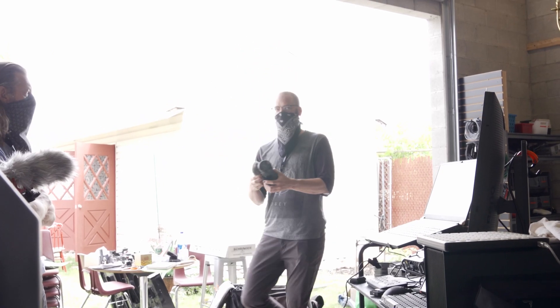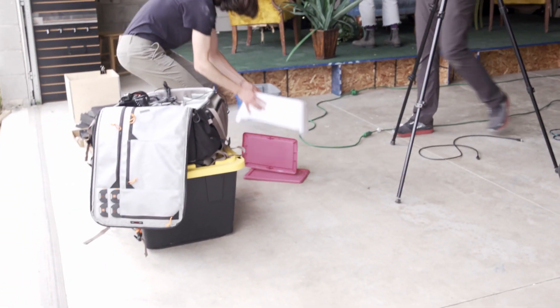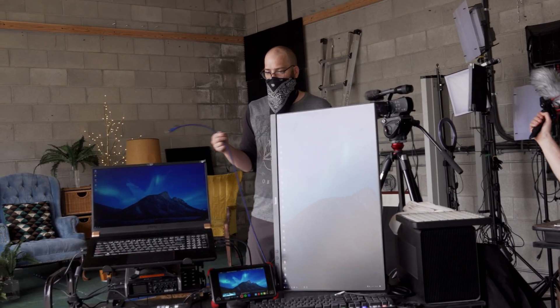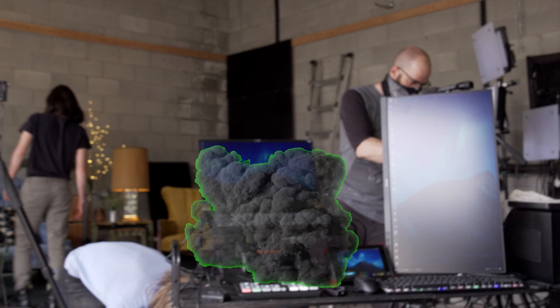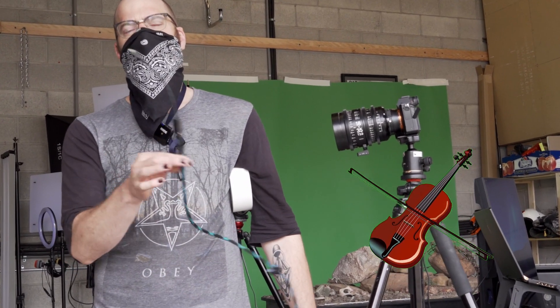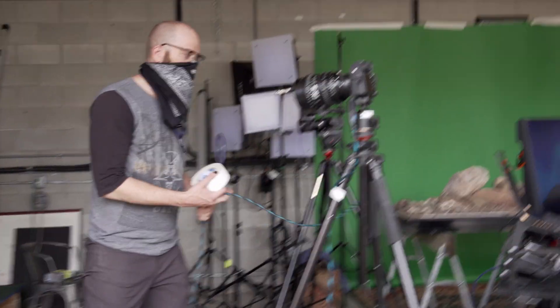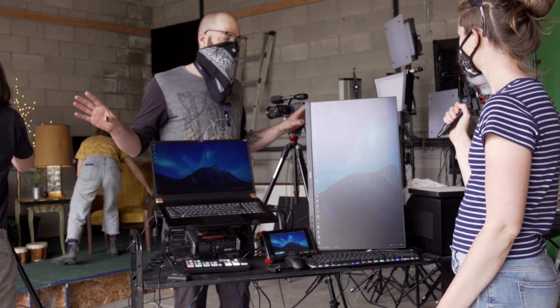Let's get a camera set up. Here's a camera with power. This one requires a mini HDMI adapter. We're going to plug this into channel two — now we're cooking with gas. One thing I want to harp on is the fragility of the micro HDMI standard. It's a terrible design, very weak — these adapters break constantly. So just to be extra safe, I tape the cable down so there's no tension on it. This HDMI is going to be our A-cam; plug it in.